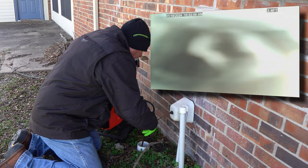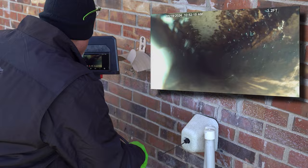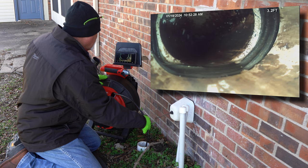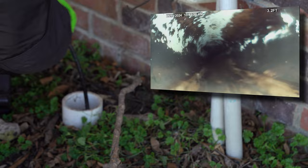Right now we're going up towards the house. It doesn't want to go very far - there's a connection, looks like a fernco gasket or something right there. I can't pull back far enough to move it around to see it, but it looks like it may not be dead center. We may need to come out and dig this up and move it around, but I'm going to go ahead past it because I want to come in and see if there are any problems up under the house.